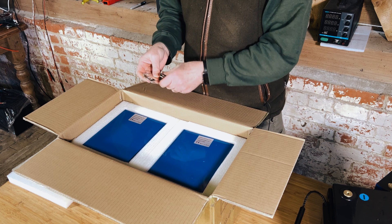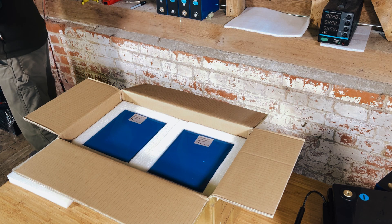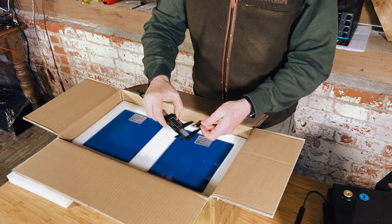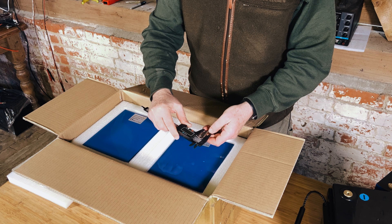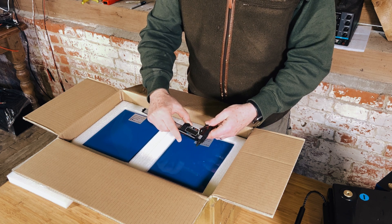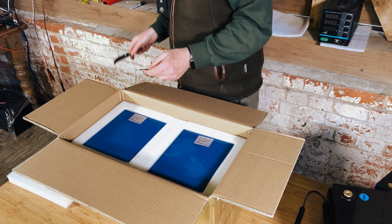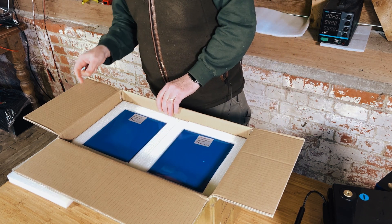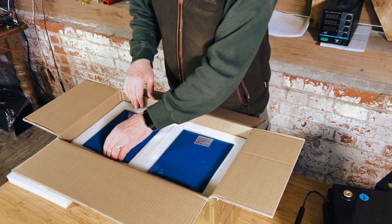They give us four bus bars and they look okay, all wrapped up. I'm curious to see what the dimensions are — they should be 19.8mm, and this is the important part: two millimeters thick. So many of them sell you one and a half millimeter thick bus bars, but this is two millimeters thick. That's a fairly good bus bar — I don't have any complaints.